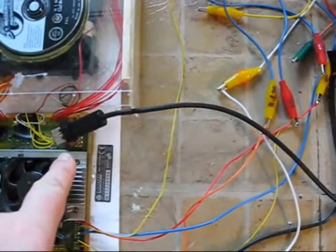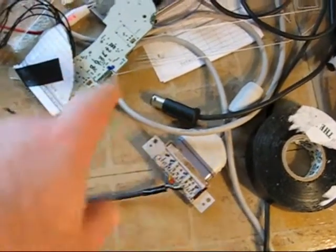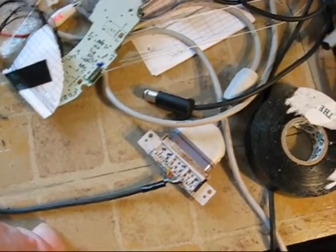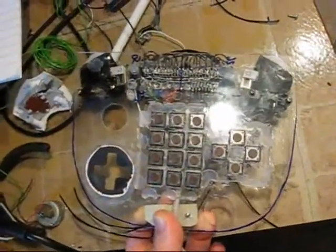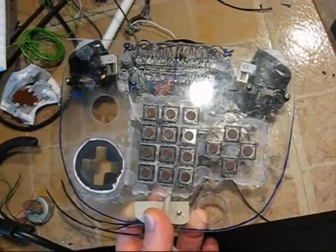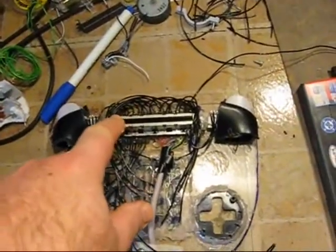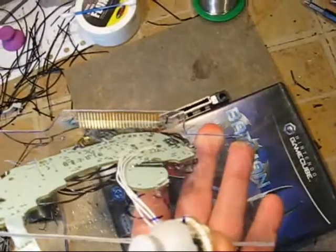This is a cable that goes to the controller from the base unit. What I've done is to put this into a PlayStation port so that the plug can be easily removed. This is on a six-foot wire, as you'd normally get with one of these controllers, because after all this isn't going to be a handheld portable. And this is what the master controller looks like — all the connections are wired into an N64 game port, and I've opened up an N64 game cartridge and utilized all the pins there to connect.